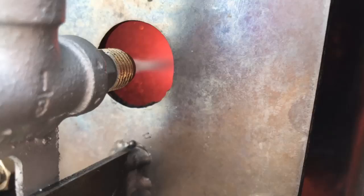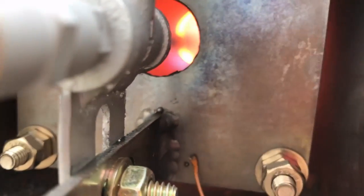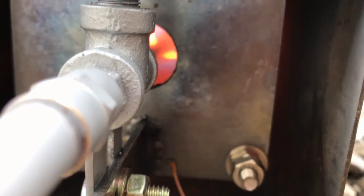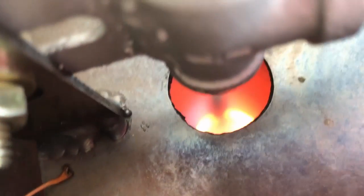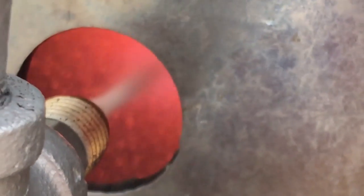We're starting off with the re-crystallized silicon carbide burner and we're going to see the drastic difference in performance. As I said, this is a pretty good burner. This thing's more like an airplane engine, whereas the other burner's more like a rocket engine. This thing will last and last. It will not burn away, whereas the super high temp preheat burner only lasts about 400 hours before you start to burn pinholes through. But that's just kind of a sacrifice you need to make to get those higher temperatures.